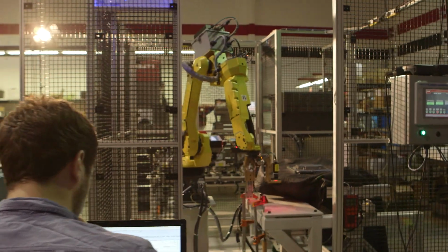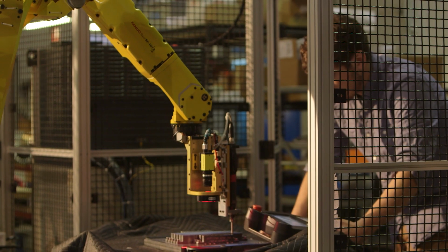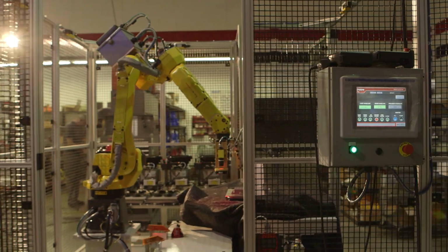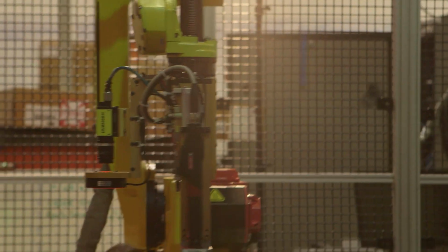Using the Agile technique, we were able to verify that all of these techniques were going to work long in advance of the actual manufacturing and assembly of the machine. That way, as soon as the machine was built, we already knew that we could find these holes with the camera and accurately bring the screwdriver right on top of these holes using Desoutter's driver and our Cognex vision system.